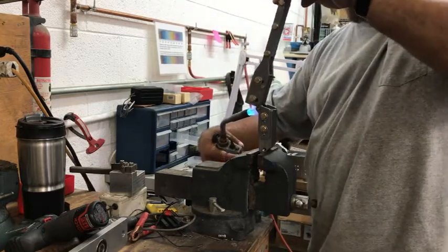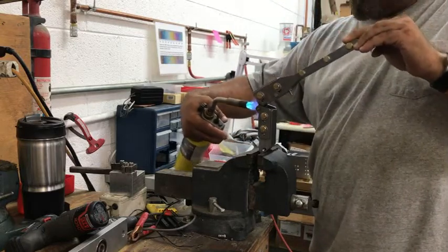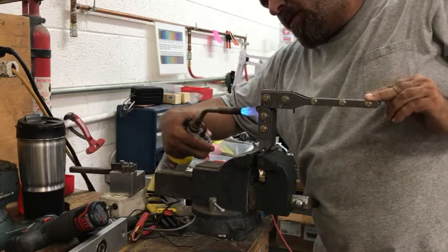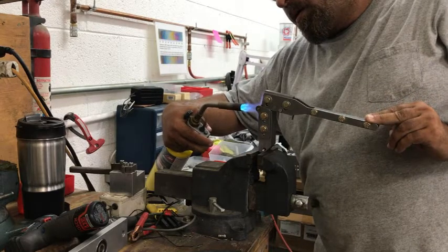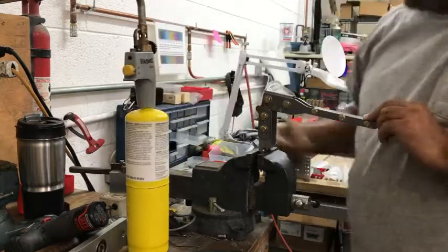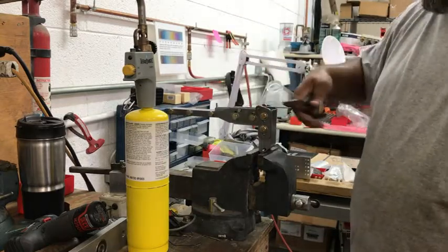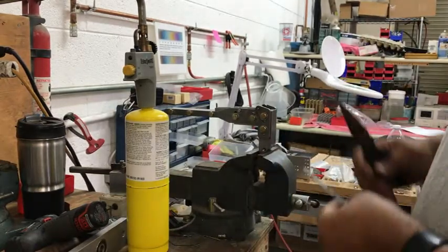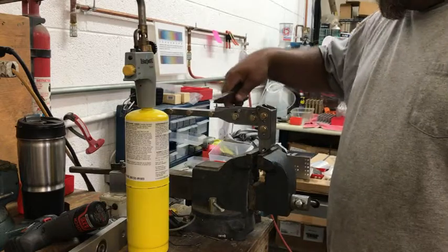And you'll get a feel for this. I could feel the material getting tight and getting strong. So I slow down and apply more heat. Hold it for a couple seconds and let it cool. That seems to set that radius. Get that out of the way. That out of the way. I've got a relatively large hunk of aluminum there that I use as a heat sink. I set those on. So this is gonna go back on there.